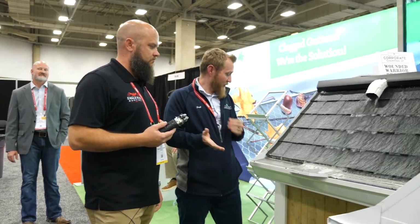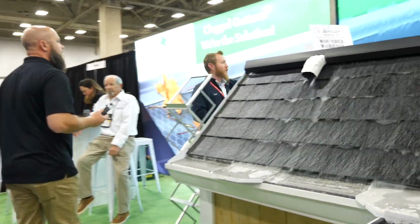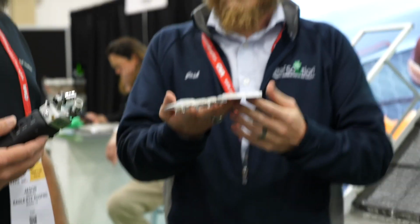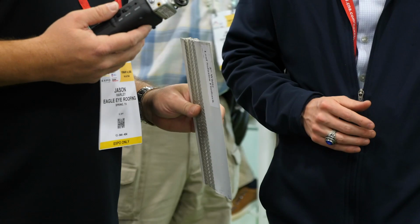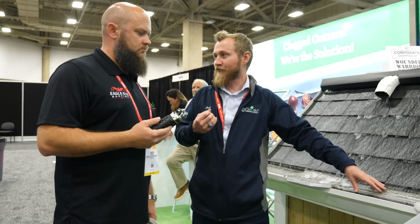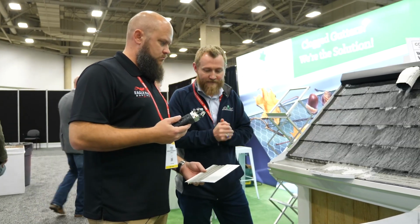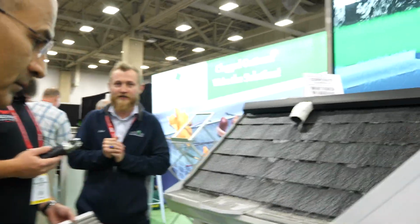Yeah, so you brought up a great point, and another feature of both of our mesh products, and I'll get one for you to hold, is that they are extremely durable because of our patented hemming process that bonds the four pieces of metal together. But more importantly, they are intentionally made with a very lightweight design. I'll give you that to hold. That's because in areas where you might get a lot of debris, or more importantly, ice in your gutters, you don't want to add weight to something that already gets ripped off from unnecessary weight from bad weather. Right. But I would say an entire 5-foot panel, which is what these come in, and get seamed in between, this one right here weighs barely a pound for Leaf Solution. Awesome. For an entire 5-foot section.